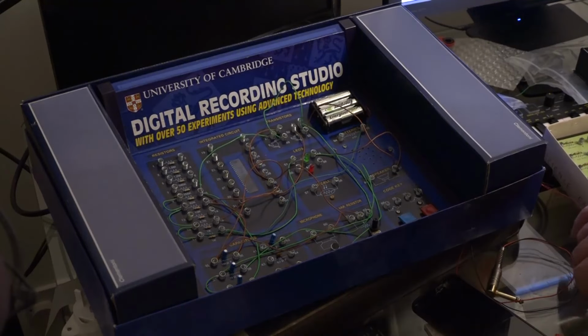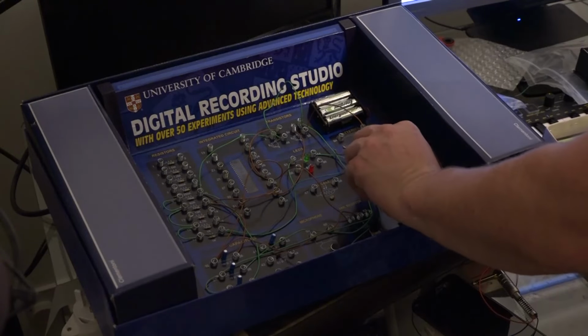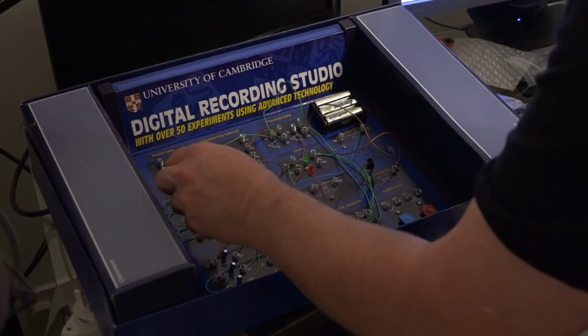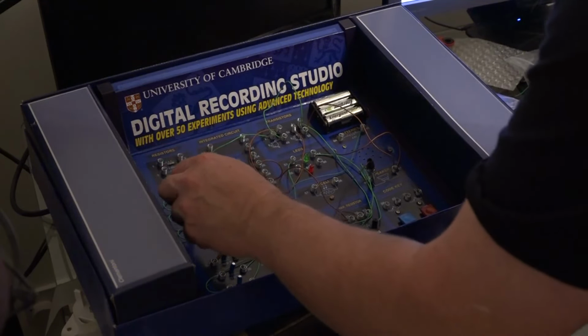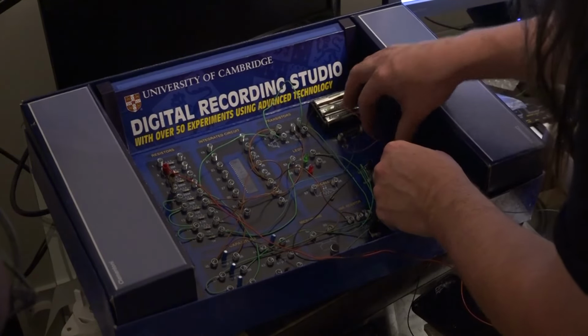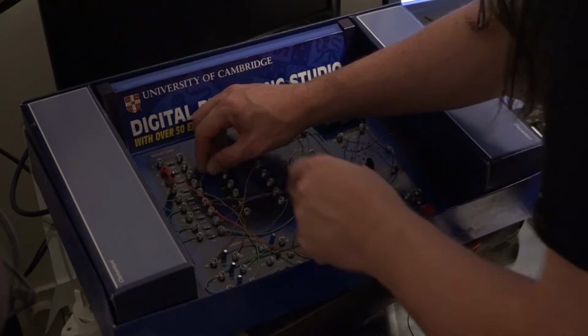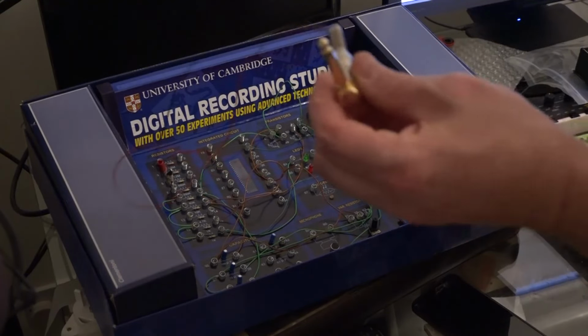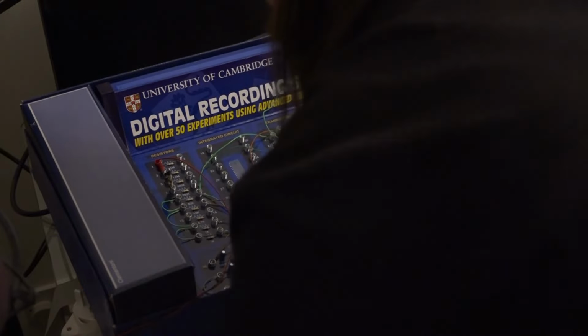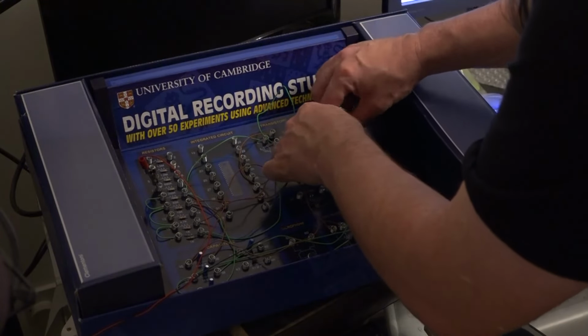This then is our circuit. And I'm going to take one output of the speaker, the ground there, and pop it through a resistor, say 680K. And I'm then going to hook another wire across, just so that we get a bit of lower level, and hopefully it's not going to blow anything up. It should be all right just tapping off the speaker because it's very quiet. And then we just get this lead, and I'm popping that into my audio interface. And then if I switch it on, I should be getting something coming out of the speakers.